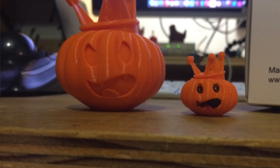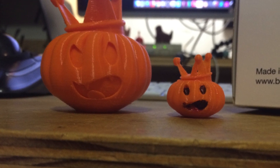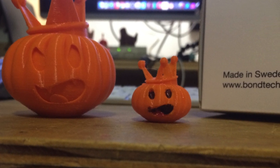I put in Capricorn tubing — 3mm inner diameter tubing — in my hot end, and this was the first PETG I tried since then. It printed beautifully. I've only done a couple of small things with it; I'll show pictures of them.